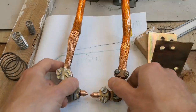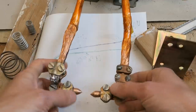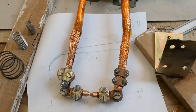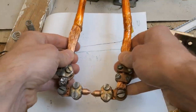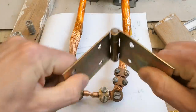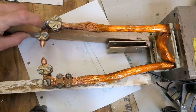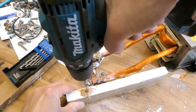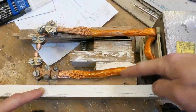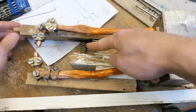Now it kind of starts to look like proper spot welder tips, but I have to build some construction to align them so they go against each other instead of dangling in the air. It's also getting hot, so there is nothing to grab by hand. I plan to use two wooden planks with a hinge in between and maybe some springs so it goes back automatically — the transformer will sit on its side on a wooden plank, and on top there will be a moving part on a hinge with a spring moving it back up.